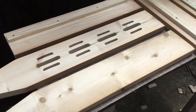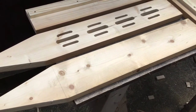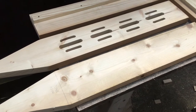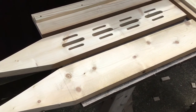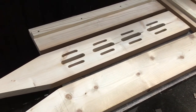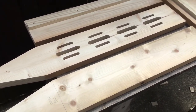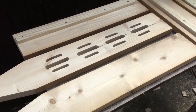So I just used it to drill through-holes on both sides. The reason you do both sides is because this is pine and it splinters and splits, and it will wreck the surface. So going from the top, then turning it over and going from the bottom at the end of each slot. Mark your slots out, drill a hole at each end — the smaller slots are three-eighths.